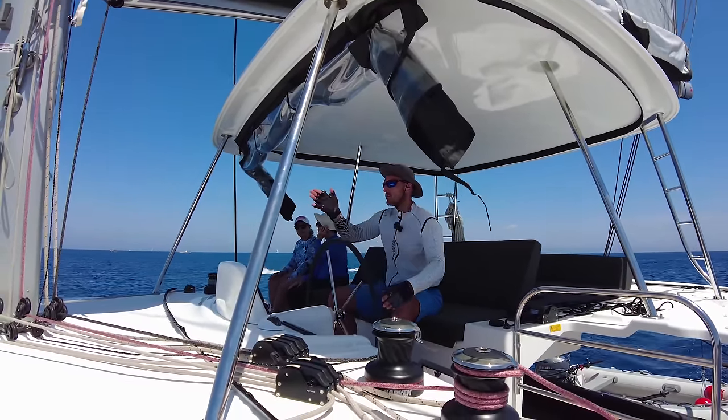And then usually I go from here, because you want to control how nicely it's furling. So the guy pulling, actually the guy right here is more important than the guy pulling, because you have to control how loose, how tight it furls. Let's go, yeah? So he's pulling and I'm just keeping just the right tension to make the sail furl nicely.